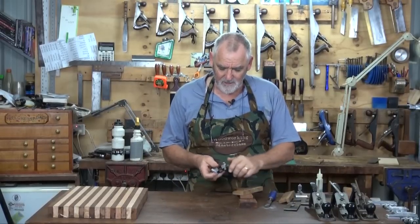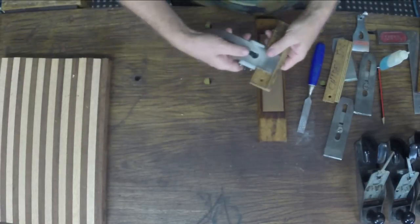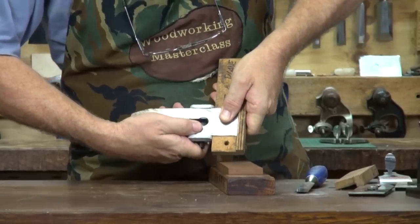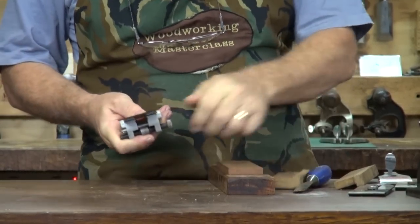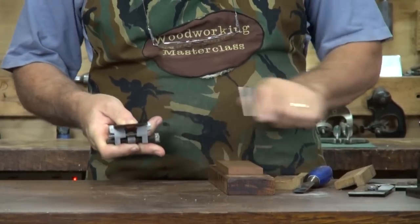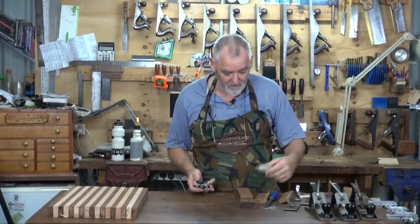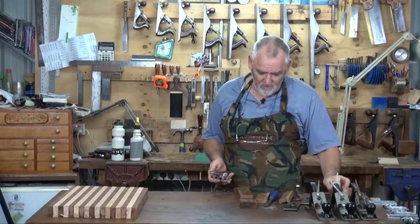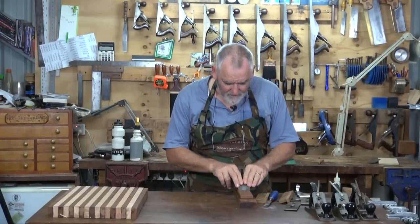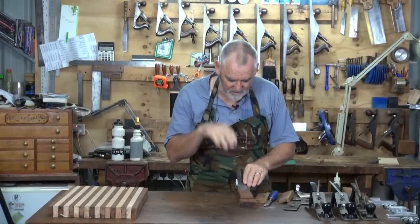All I have to do now is just nip that blade up a little bit, put the edge of the jig up against the honing guide and just move it in so the honing guide comes up to the edge. Nip up the side bit. Locking caps make good screwdrivers. And there we go. Now, a little bit of Kero is what I use. You can use light machine oil or whatever, but kerosene seems to work for me. And then I do three, not a lot of pressure, just medium pressure.